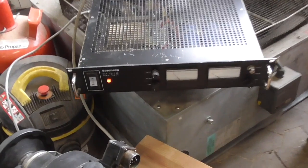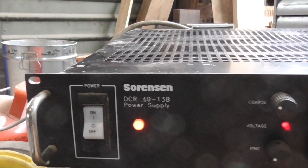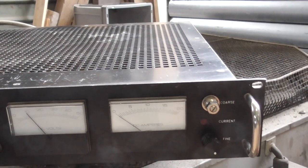So let's start. To drive the servo I need a power supply. There is a side story to this power supply. I bought it for about 40 euros in non-working condition. As it arrived, I plugged it in, switched it on and it worked, but just for five seconds. So I switched it off, looked at the back side and realized that it is configured for 110 volts and not the 230 that we have here. So one bridge rectifier, one fuse and one varistor later, it worked again.